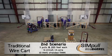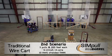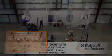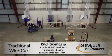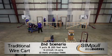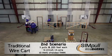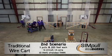Additionally, the weight of the reels and the force required to pull make it difficult to avoid over-rotation of each individual reel. This can result in loose wire, creating a bird nest effect or wire jumping off the reel and getting caught on the reel shaft. These issues are virtually non-existent with the simple wire barrel method.